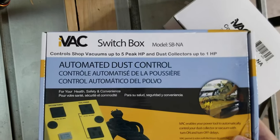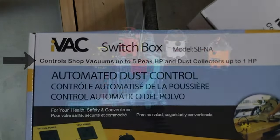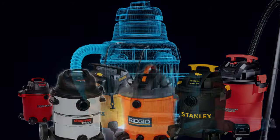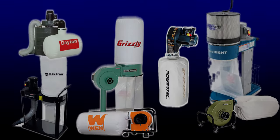Now, taking a look at the box this came in, we can see that it can control shop vacs up to 5 peak horsepower. Now, keep in mind that this means up to 5 horsepower momentarily at startup, and is not to be confused with continuous horsepower, which is limited to 1 horsepower. The switch box can also be used with dust collectors up to 1 horsepower.